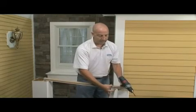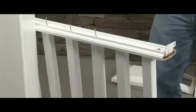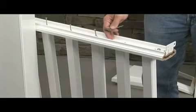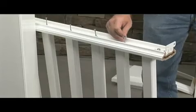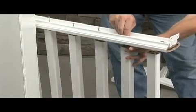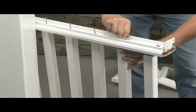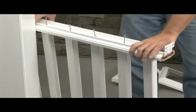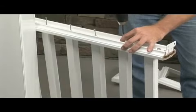It's important at this time, if your drill has a high-torque, low-speed setting, to set your drill there. Once all your balusters are screwed into the retainer rail, flip the section over and place your bottom rail onto the balusters. Using the longer screws provided, place the screws through the hole and line them up with the chase in your baluster. Finger tighten all the screws, then drop the rail down and come back and tighten all the screws down.